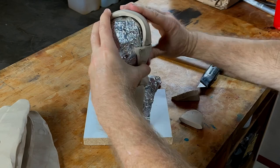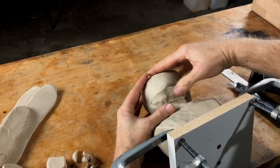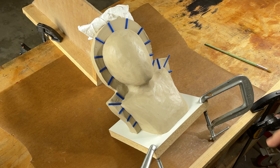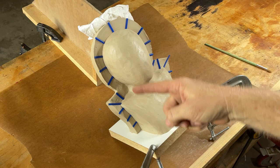That's the whole idea with this process — it gives you really good control over the shape of the rubber blanket. The clay work does not have to be a masterpiece; it's only a blanket mold so it's never going to show. This is the parting line dam, and on it I used wax rods — half-round rods — laid on there. Those are going to provide the key, which is going to lock the two sides of the mold together.